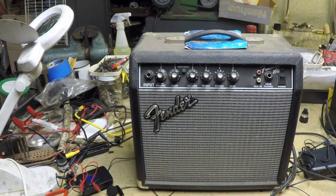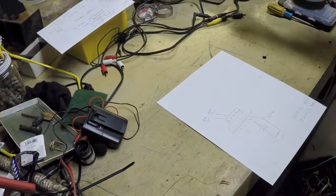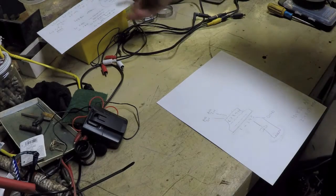So you can imagine if the GoPro's audio circuitry is expecting to see a level as tiny as that coming at it, and instead it's seeing a level that's like 10 times as strong, it's really kind of being overwhelmed. So there's probably a lot of automatic limiting that's doing its job, and that's probably the only reason why the audio was half decent at all when I first tried this thing. But I think what we'll do is we'll try an attenuation circuit, and we'll see what the audio is like after we do that. All right, back to work on the microphone adapter.